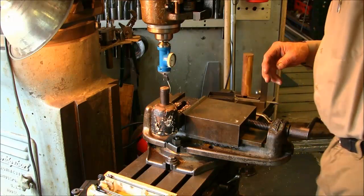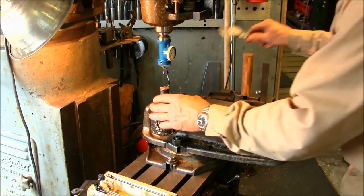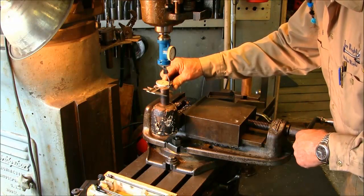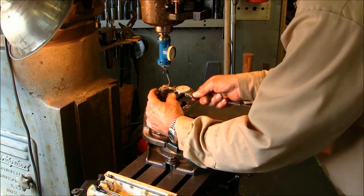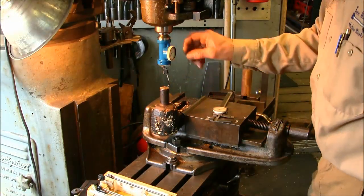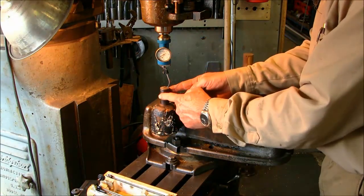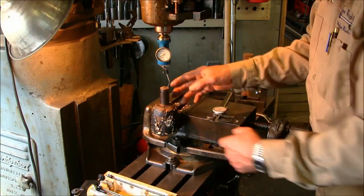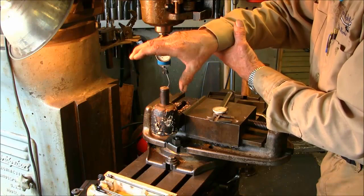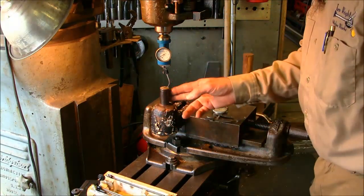Now the reason why it won't get any better than about the 5, and we'll find that, is a difference of this length right here, which is 972 and 986. So there's no way that we're going to actually get this to stay on 0, because we are fluctuating in and out as far as the ovalness of wear, because the bell trunnion or yoke only pivots part way. So all the wear is on this side here and not on this side here.